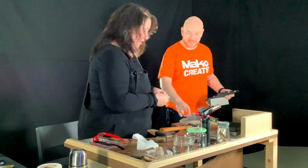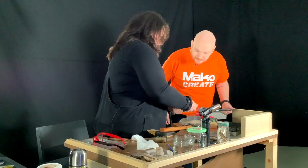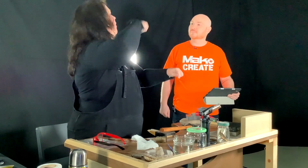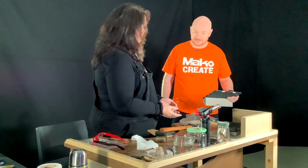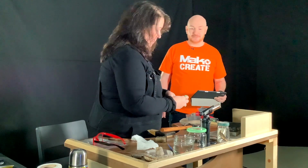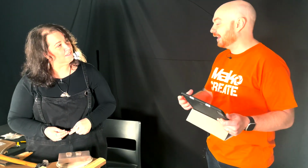And did you call this a die? This is a die, yeah. And obviously it's got lots of different impressions in it, as you can see. I've actually got rolling mills at home, which have these impressions in, so I can just roll a big sheet, which makes it much easier than doing this. But this was the traditional way that things were done originally. And some of these dies are actually antique Indian dies. So we've got five patterns on each, and you can get them in all different types of patterns depending on the type of jewellery that you're trying to make.